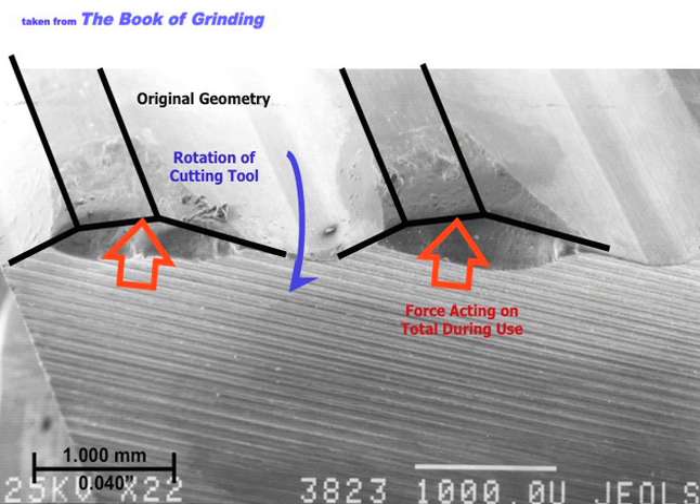Here are a couple pictures of various tools I've received over the years, people saying my tool didn't do well — why? Here's one, kind of an end-mill style milling cutter. We can see fracture of the tool, and it occurred because the grinding scratches were too big. Grinding scratches are a stress initiator, stress concentration, crack initiation point, and we get breaking off of that cutting edge.